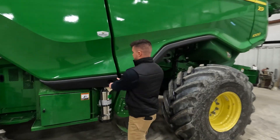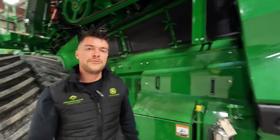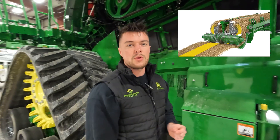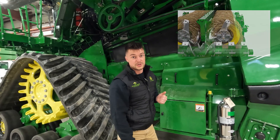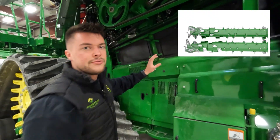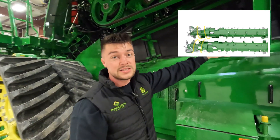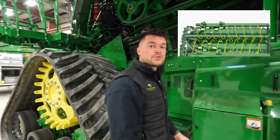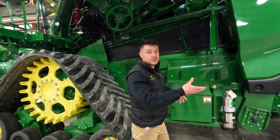Let's talk about threshing. Getting under the gull wing here on our X9 Combines, we have dual 24 inch wide rotors — a little different from our S Series, which are single 30 inch rotors. These twin rotors are designed to spin about twice as fast as that single rotor on an S Series Combine. In our threshing chamber we've got 45% more capacity in space and about an 80% size increase over the S790 Combine's separating area. This rotor is designed to expand into three bigger chambers as the crop works itself from front to back of the machine, allowing us to get a really good grain sample as it gets into the cleaning shoe.